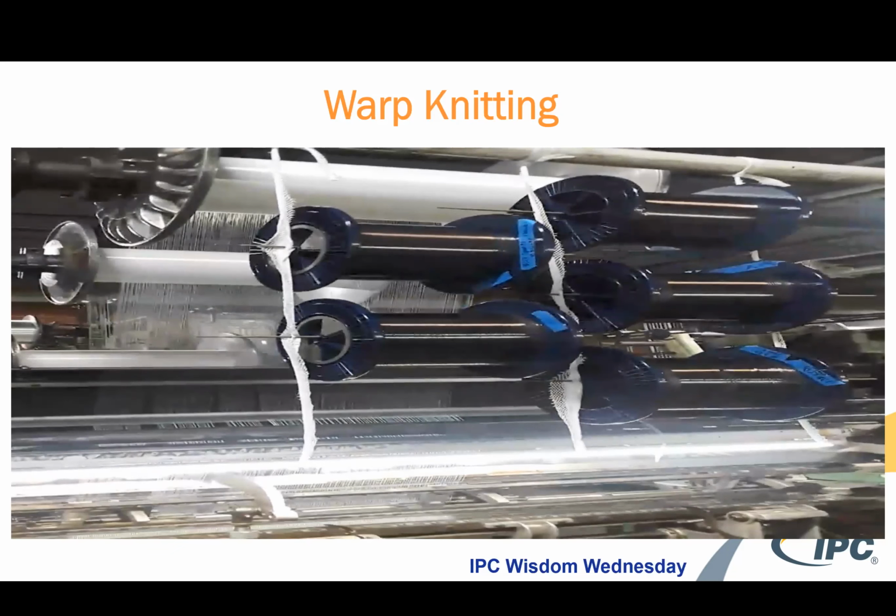And so it's important, especially when you're prototyping, to start out slow so that you can give yourself the best chance to not damage the conductive material if it happens to be very sensitive, although there are a lot of conductive materials that will run at near full speed as well, but they might not deliver full communications. You have to level set your expectations based on available equipment, available yarns, and what you want the functionality to do. Maybe you can't have all functionalities the first time, and you work your way into adding the functionalities over time.